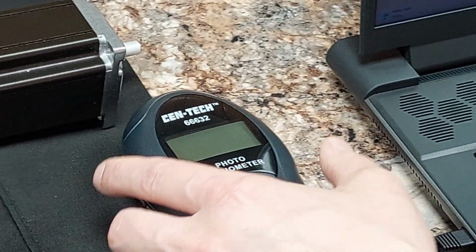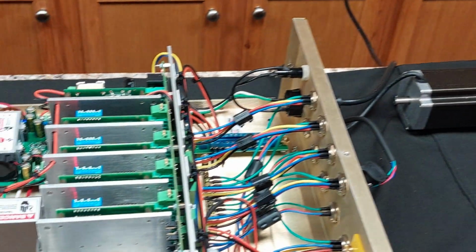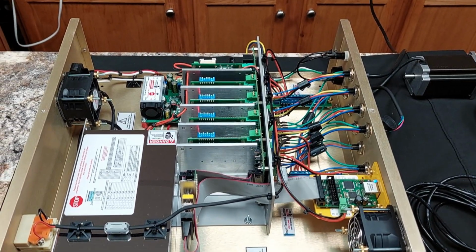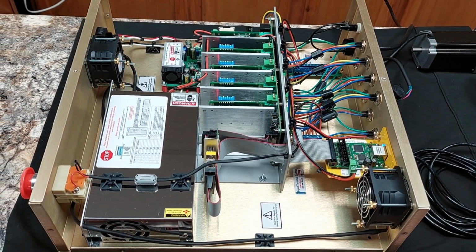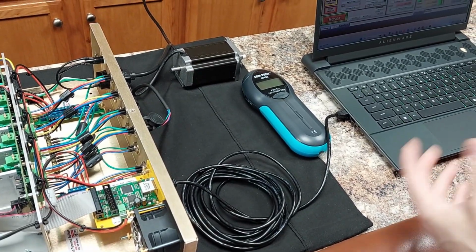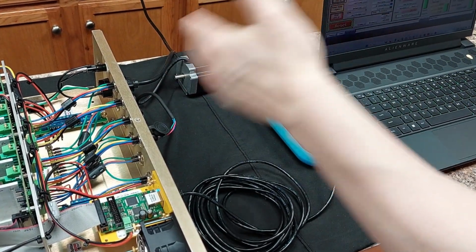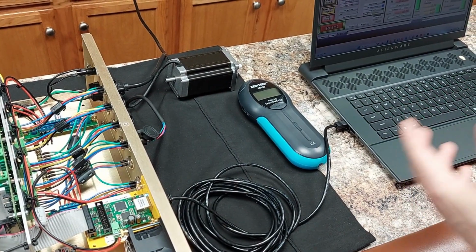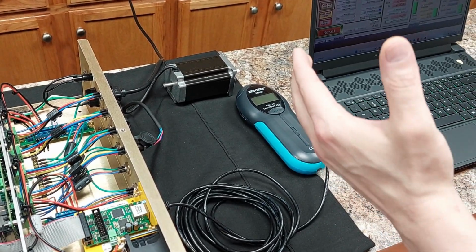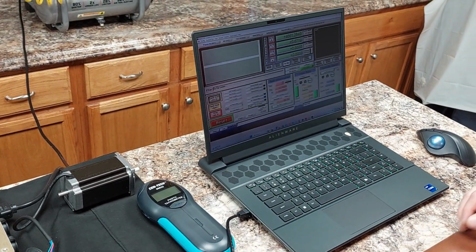Whether or not this motor naturally can hold torque and provide usable motion at that RPM is really not as relevant as the fact that you will get a percentage of that for rapid motion, meaning when you're just moving your axis from one point to another to begin machining. That's when the machine works the fastest, because it's trying to just go where it needs to go to continue the machining process. If the machine is unloaded, you still have a more usable amount of RPM to jog that machine to those locations faster, which once again provides faster machining time.